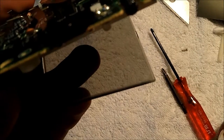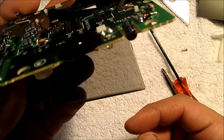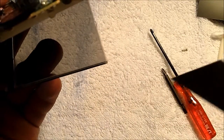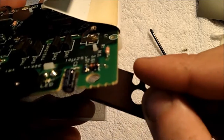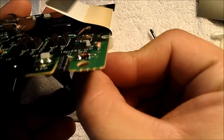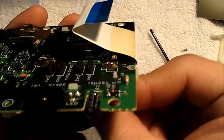There is a bit of residue in the corner from where we started cutting. We're going to use the razor blade, dip it in some rubbing alcohol, and then carefully work off the residue. This is the easiest way to remove residue from behind the LCD screen. Just be very careful you don't cut into the ribbon cable or scratch the glass.